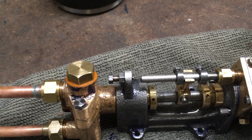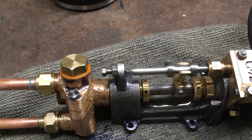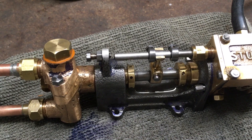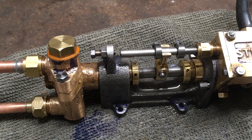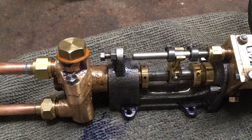This is it running slowly. You'll notice that the two stop collars on the valve are adjusted for quite a short stroke. This is because it was very tight initially and it wasn't very happy running at the end of the stroke — it got better as it ran. You can also see that it's leaking a fair bit because I left the gland nuts quite loose.